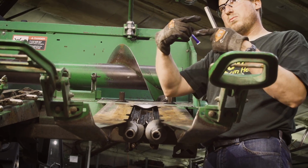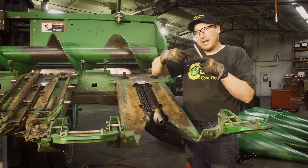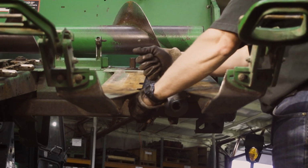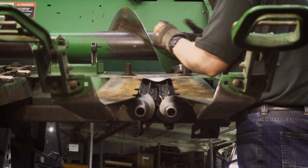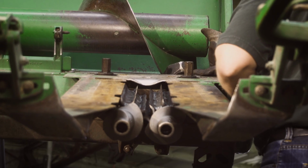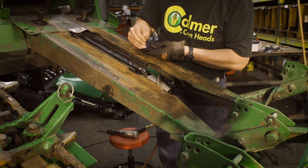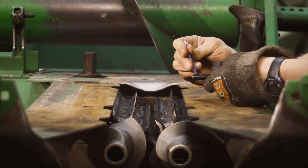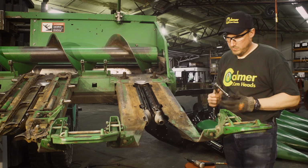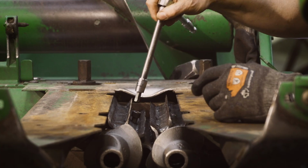Very important, we want to start both bolts. We want to get them both in, not torqued, but both started. If we put one in, torque it, there's a chance we will spring the clamp a little bit. We won't be able to get the second one started. They take the 3/8 Allen head, should come with your instructions. Want to get them started.